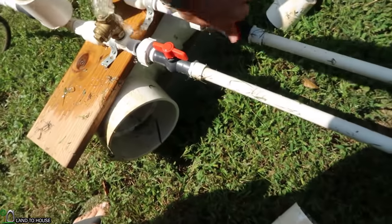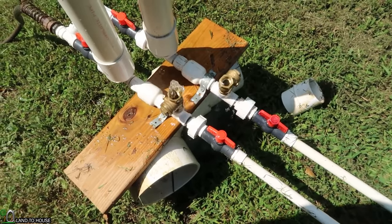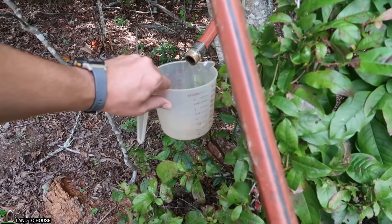We're going to turn on the second pump and hopefully they will work together. Now this one doesn't cycle as hard because of the 90° fitting that's up here in the drive pipe — I didn't have the fittings to do any better than that, so it's not as good. Let's walk back up here again and see if our output is better than four ounces in 30 seconds. Let's see what we got in 30 seconds with two pumps running.